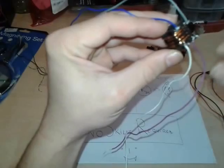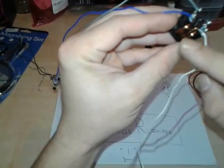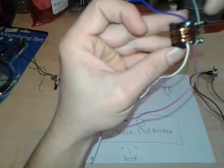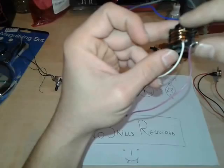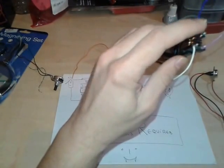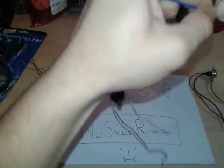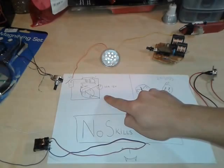Be very careful when you're gonna hook up the leads. Basically this one, what I'm showing here, is wound like this and ending here, and this one is the same, starting from here winding to here. So basically we're gonna connect two opposite windings — the first of the second one with the second of the first one. We're gonna hook it like this — that's basically it with the inductor.